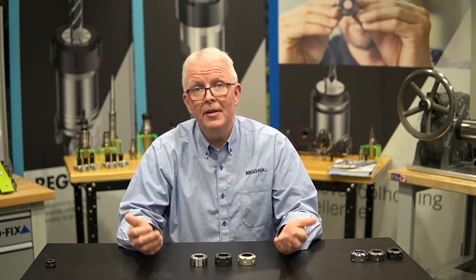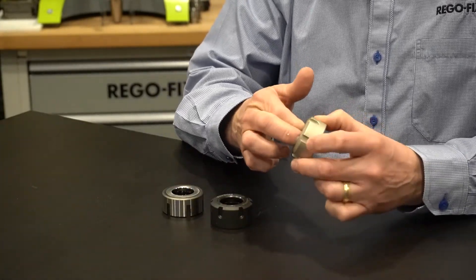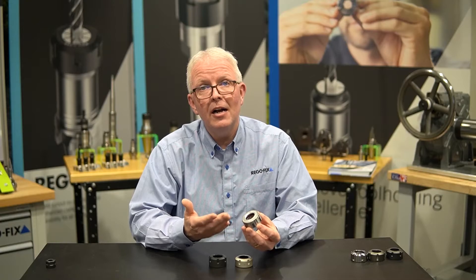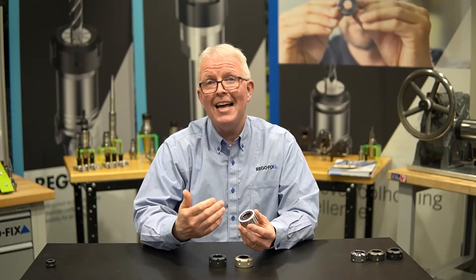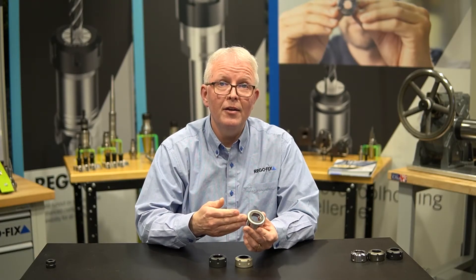There are a wide variety of different types of collet nuts available, one of which is the bearing type nut. We talked about what to look for in a standard one-piece nut, but what about the bearing nuts — whether it be a true ball bearing style, a friction bearing style, or a loose fit slip type ring on the inside? Because they have moving parts, the easiest thing to look for is whether the parts that are supposed to move still move freely. If you have a regular bearing style nut, hold the ring and rotate it — is it nice and smooth, or can you feel flat spots on the bearings inside? If you can feel any kind of resistance or vibration as you're rotating it, it might be time to either rebuild the nut or replace it.